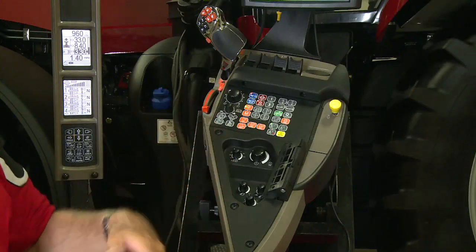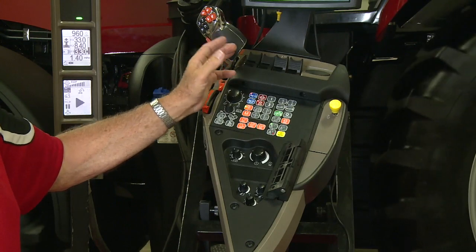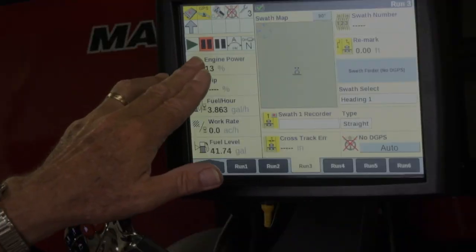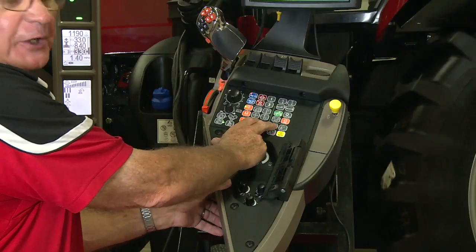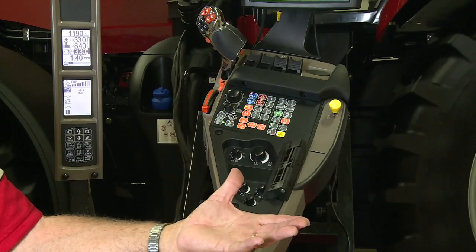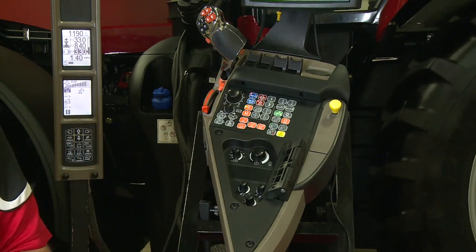If you recall, I said I like to program the unit with the implement down. The reason for that is if you go back through the playback and the operator messes up — let's say it's raising and I pull a remote valve — I've got a double problem. So what I'm going to do is manually put the implement down and do everything manually. Then I can come over here and turn the system off. When I turn it back on, I'm right back to go, and I don't need to go through all of those symbols and understand what they all mean. Everything falls right back to work.